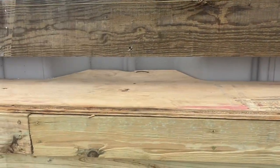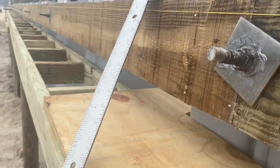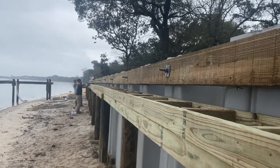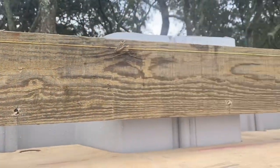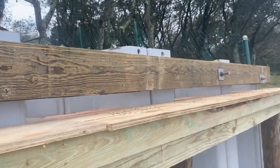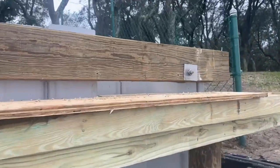We've got three-quarter plywood that goes back into the corrugations. We've got to keep the concrete from getting between the vinyl sheet — it runs the whole length of the wall. We've got holes drilled in this top whaler right here, with rebar going into that, and then four runs of rebar running all the way down the wall. The chair rebar, or box rebar that goes over the wall, is going to be on a foot-and-a-half centers all the way down.